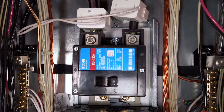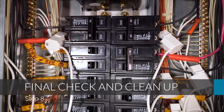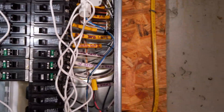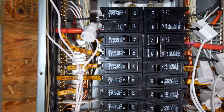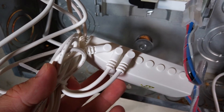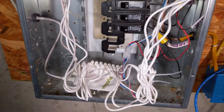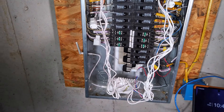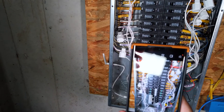Here we are with our completed panel. We've got the main incoming CTs at the top, and then we've got all of the smaller CTs on the circuits that we care about. We have all of the wiring pulled out and now we need to clean the wiring up and connect these in. Now we've applied a little bit of cable management and it's time to go ahead and attach the adapters to each of these individual plugs. Make sure you have any unused plugs still covered with the caps for safety reasons. Now we've got our completed setup — it's a good idea to go ahead and take a picture of your entire system so you can document where each of the CTs are.